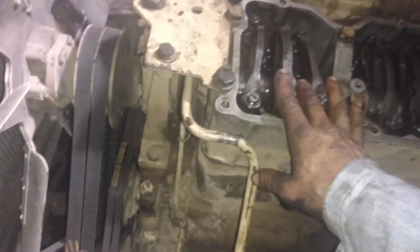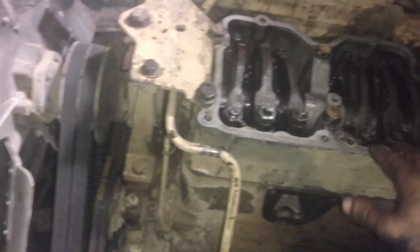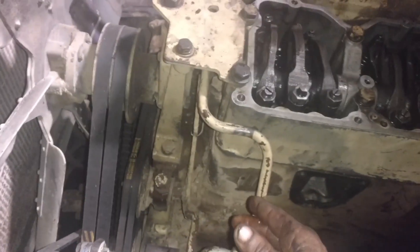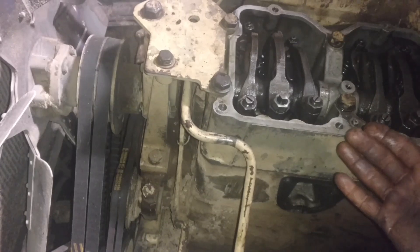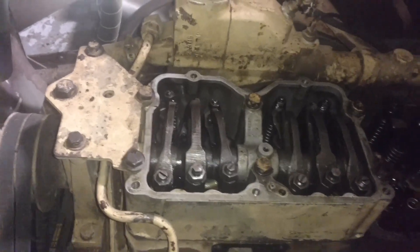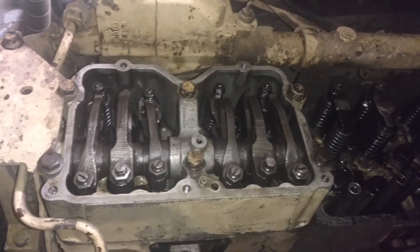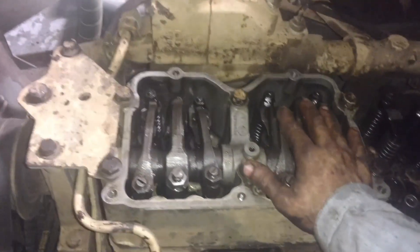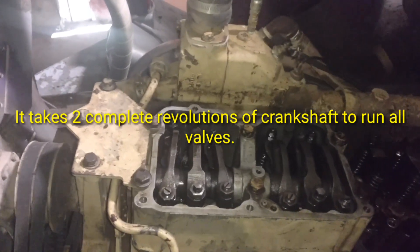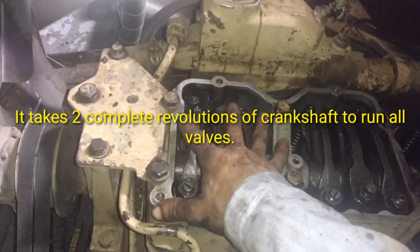This is going in firing order. You'll start out at A and say you're on cylinder 1, then you'll go to B which is cylinder 5, then you'll go to C then cylinder 3, and basically just keep going around — 1, 5, 3, 6, 2, 4 — and adjust your valves in that order. You'll have different valve specs though. I've got a 444 over here in the shop too, and they're 14 and 27 thousandths, but these 290s are 11 and 23.